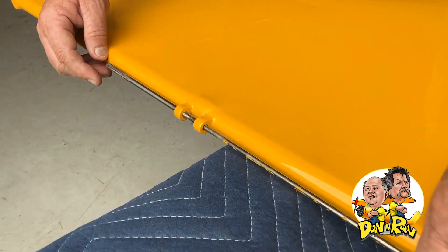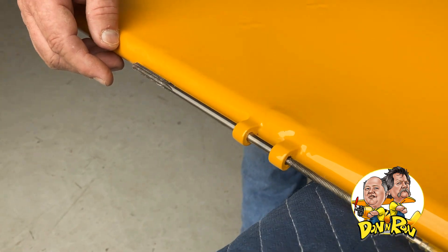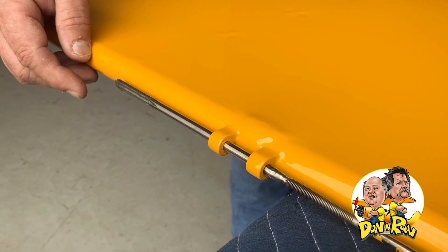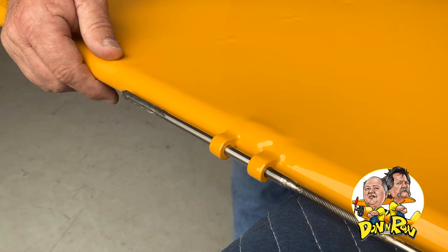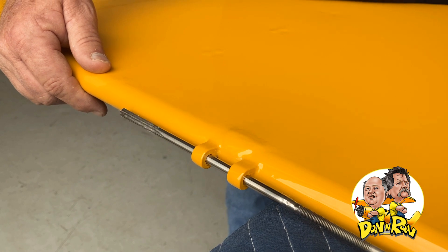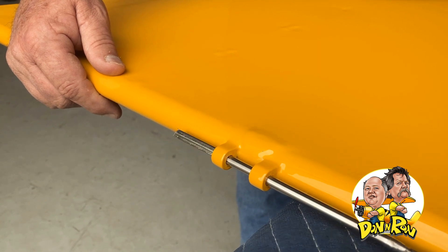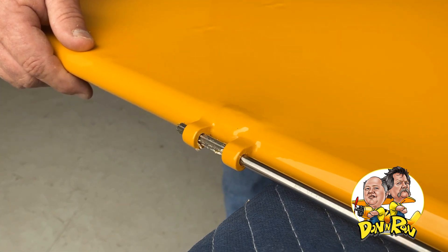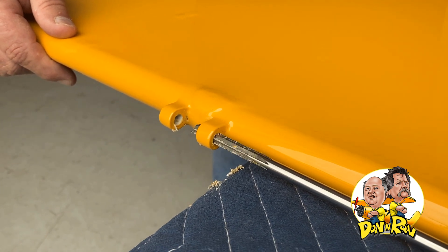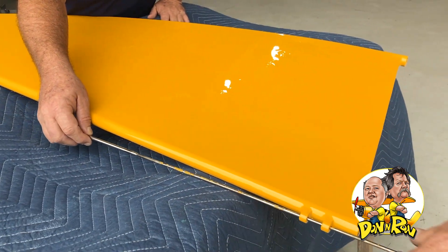All right, let's give it a shot here. You see Michael's zooming in, getting us a real close-up shot. You don't have to turn the drill fast. The bushings are already nice and clean, but we just got some paint and primer in there, so we want to get all that out. He's just pulling through nice and easy at slow speed. Now he's ready to start cutting some of that old paint stuff out — see what comes out of it? Pretty straightforward, nothing complicated. You're not really getting into the brass at all, but you are reaming it to the proper size. He's going to pull that on down through there.